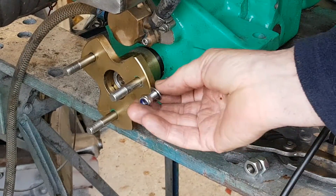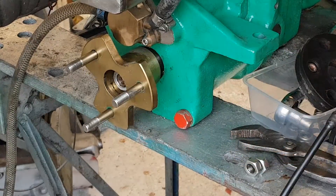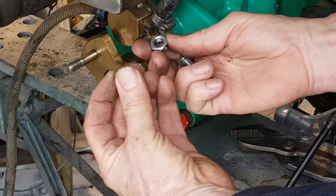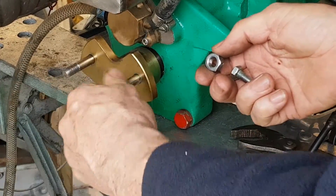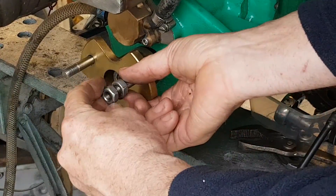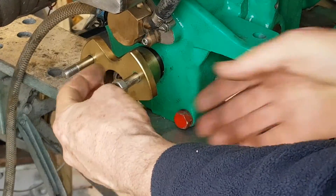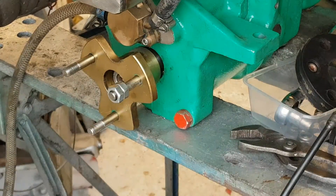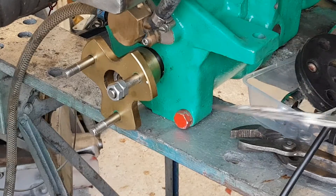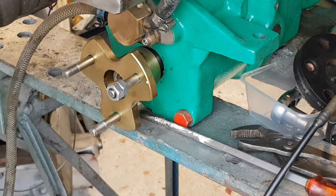What you're going to do is put these bolts through the holes once you've taken the existing ones out. We're going to take them out using these two 17mm nuts, which I supply with the kits. The only other tool you'll need is something like a crowbar to put between these pins when you take them out, to stop the shaft turning.